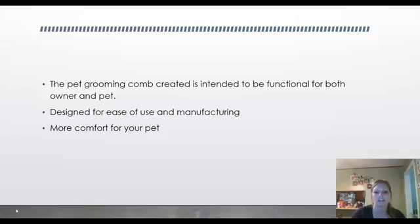On the original design, the manufacturing company began with cutting long pieces of brass bar stock into the receiving rail component. Then a computer-guided saw slices the stock into specified lengths. Next, a computer-controlled drill makes holes for the rivets and holes for the teeth in the receiving rail. Afterwards, the saw cuts extruded aluminum into specified lengths to create the handle. The material has already been preformed before entering the facility, and the comb has 2 rivet holes put in it to hold the receiving rail into the handle.